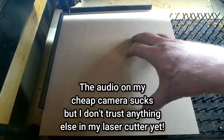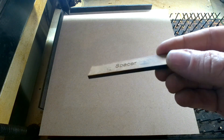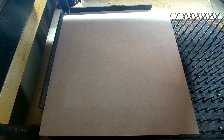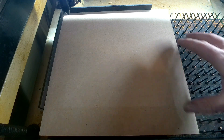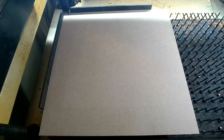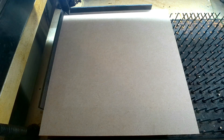We're over at the laser. I've got the Medite MDF set in here, focused roughly to this point with my two-inch spacer for the two-inch lens. I'm going to do exactly the same with the Builders Merchants MDF to see if it makes any difference. I'm going to do a cut and engrave on this one, then the same on the other. I've cleaned the lens and mirrors. The temperature right now is 18.3 degrees. I'm also going to do a sample cut — a little heart — and we're going to try and paint them both.